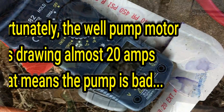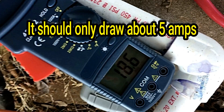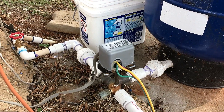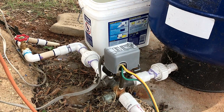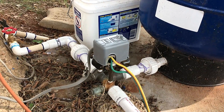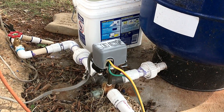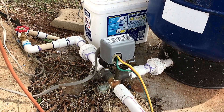That is how to replace a water well pressure switch. Unfortunately in my case that did not cure the problem because the problem is in the motor — the switch was kind of crapped out anyway so it didn't hurt to replace it. They're not that expensive; the best place to buy one is on Amazon — I got one about $15 cheaper than at Lowe's, so I'll put a link below. I still have to get the service people out because the problem is down the hole. I will video the pump replacement — look for that video coming up soon.